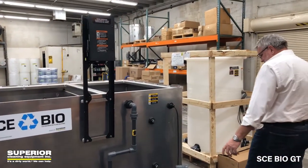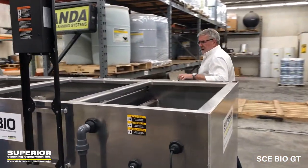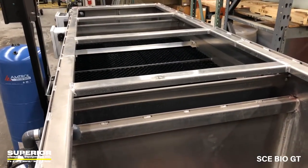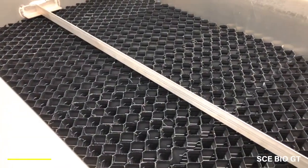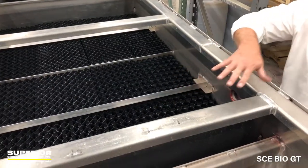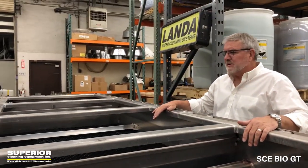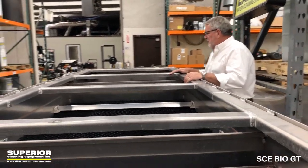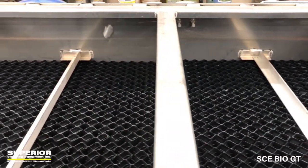If you want to look inside the tanks, you can see this particular model is all aluminum — won't rust. We haven't put this one up in the field yet; we're going to be doing that shortly. We've got drain valves on the back of the tank. This is all bio-media, which allows the microbes to thrive. They're easily cleanable and easily pulled out. All these sections are completely covered by the aluminum sectional covers. Not only do you have probably ten times the amount of bio-media compared to a lot of other pieces of equipment, but you've got three directional changes.